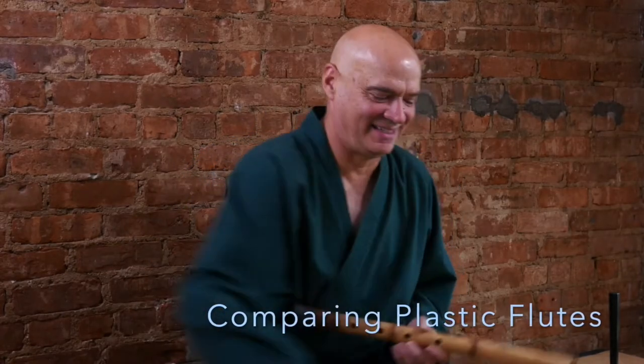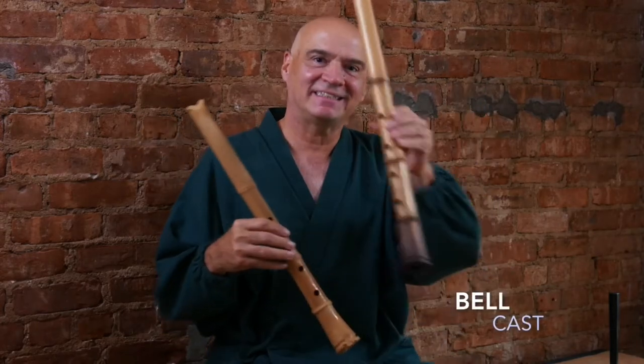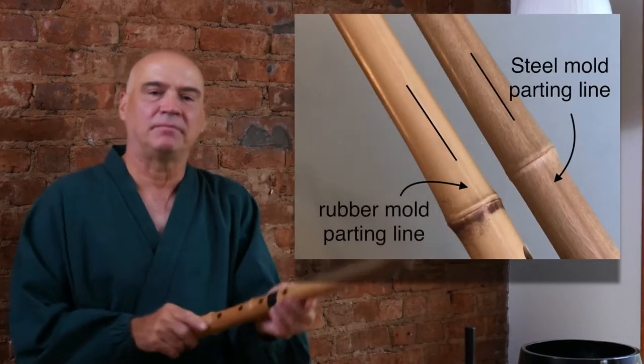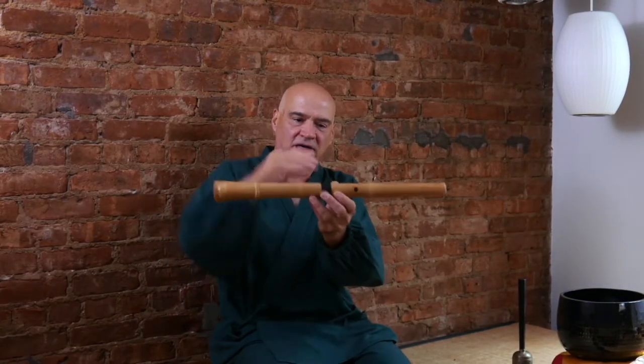I have with me the competitor: the U-flute. So here they are. This one is injection molded; this one is cast. With injection molding — and I was doing it for a while — you have a huge piece of steel, probably about this big, this wide, maybe 10 inches thick. The flute shape is carved into one end and then the other side as well. Hot plastic comes rushing through under a lot of pressure and heat — it gets so hot that water has to rush through the steel mold to cool it. It's a very involved, complicated process, but once you make that mold and start making flutes, you're really just paying for the plastic and the heat. This has been in production since the 1970s.